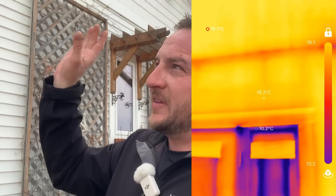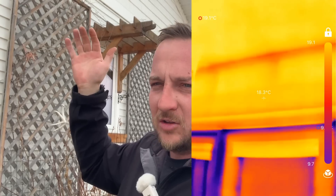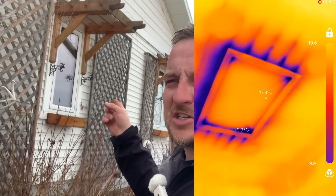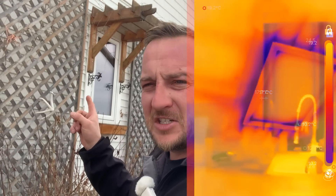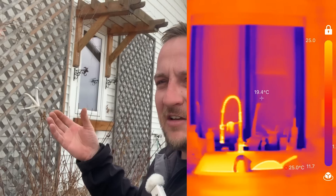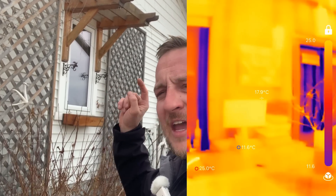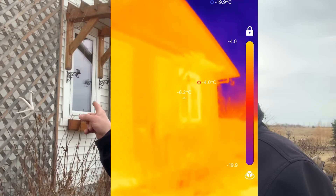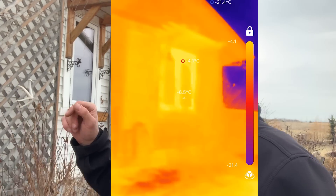When I shine it up at the attic — I put so much insulation up there — there is zero heat loss. The attic hatch you can clearly see is losing a little bit of heat. These are the best windows money could buy at the time: triple-pane windows with a resistance heating value of R8.1. These are quite good compared to a two-by-four construction house with just energy star double-pane windows — those are some crappy windows. But what takes the cake is my double-double window invention.